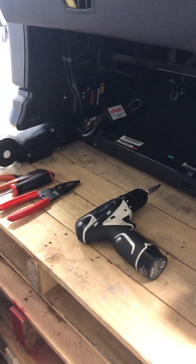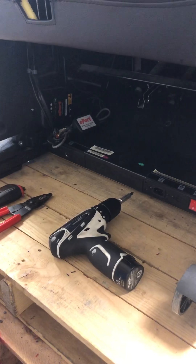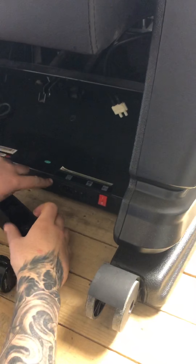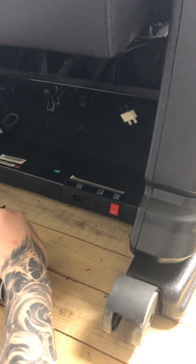Alright, so today with the Muse products we're going to be showing you how to check or install a new seat beeper. You start off with removing this plug cover which is located here. There's four Phillips head screws you'll take loose and shoot that off.